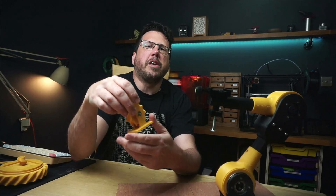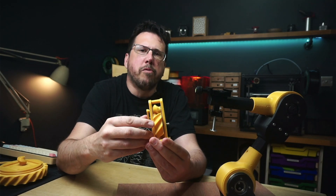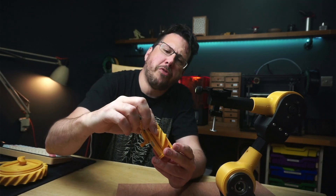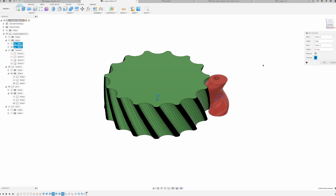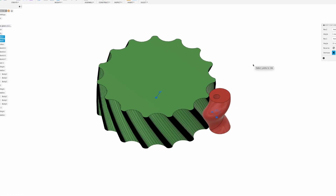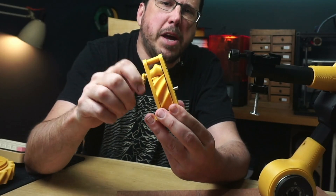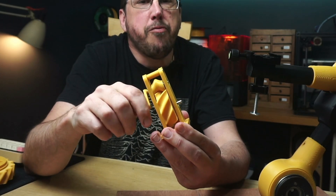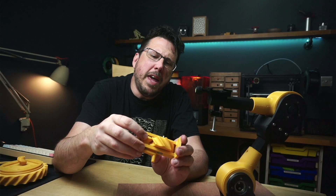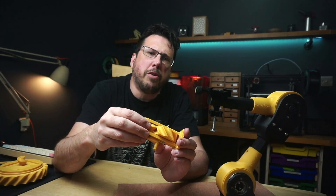In the past I've played with eccentrically cycloidal gears. This takes the disc from a normal cycloidal reducer and simplifies the drive dramatically by sweeping the nodes around it, and then using a single pin with the same sort of sweep to drive it. I've made a video on how these work and how to design them and I'll link it up in the corner. Seeing the two parts mesh and rotate is kind of hypnotizing, and it's a really nice way of getting high reduction with a minimum of parts. The pin here is basically a single tooth gear, but without the sliding friction that you'd get from a worm drive.